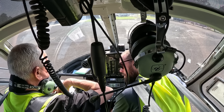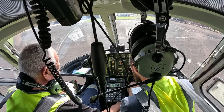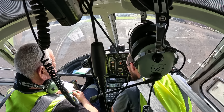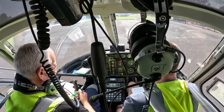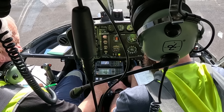When it's out it's on? Or when it's in it's on? That's a good question — we'll find out. Master emergency switch — check up position. So that switch: if you've got anything on and you have an electrical failure, electrical fire, anything like that, you push that button and you've just killed all your electrics. It is a master electrical switch. There is no reason at all, short of a fire or something, that we ever push that button.